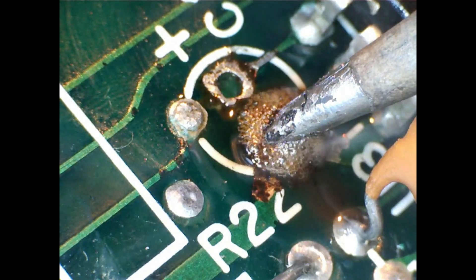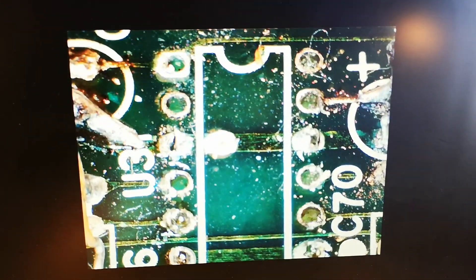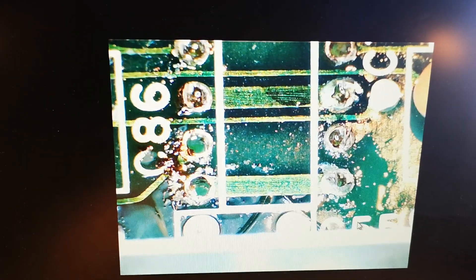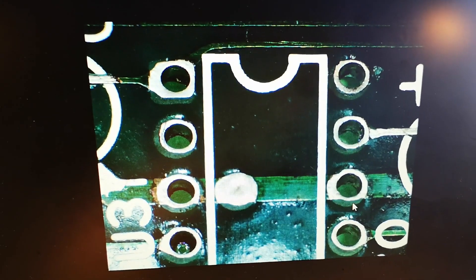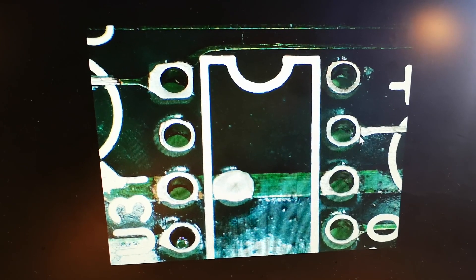You can see there's a broken trace — I had to magnify a lot to see that broken trace. I did a bodge repair just to see if it works. I don't want to do this actually — I want wires at the back. You can see I removed the chip today. It kind of looks like there's a break there, but there's actually no break there.